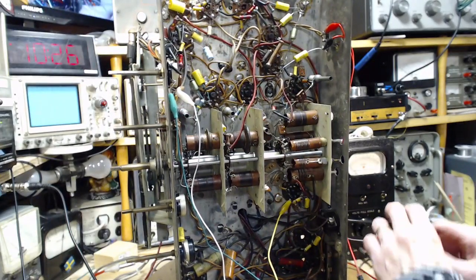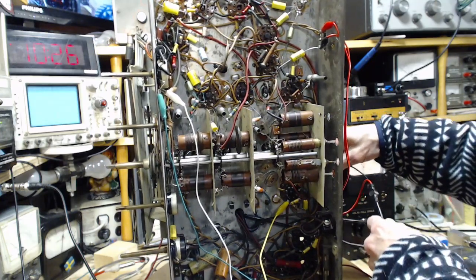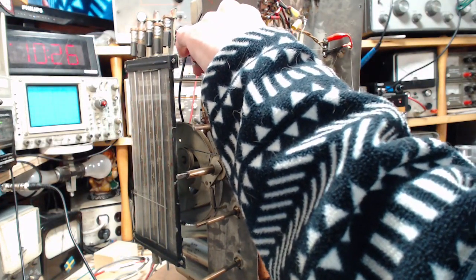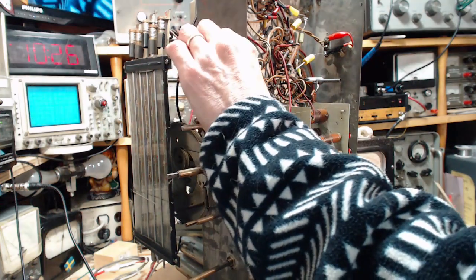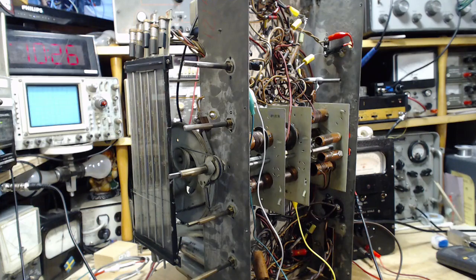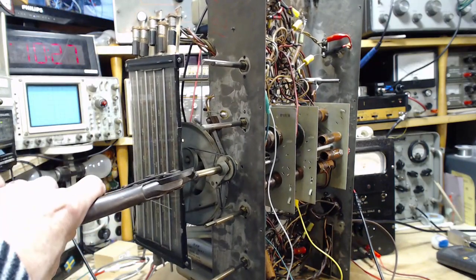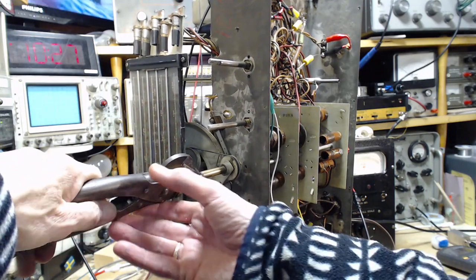Okay, I'm going to put the ground on for the antenna. Not much different. Point of that exercise is to make sure the local oscillator is working and the radio is generally working. Now, what are the chances there's a local oscillator operating way up there? We're going to go to the top band. Come down one. This is the lowest non-working band.